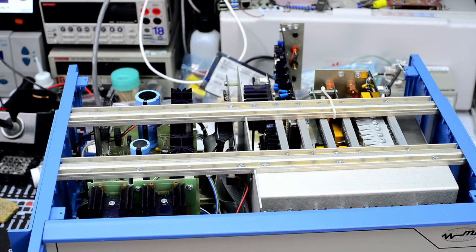Well, the taps, actually there are 16,384 taps, and also the residual between the taps is measured with the EMA10, which has noise of around 0.3 nanovolts, so that is 300 picovolts. Essentially, whatever the disbalance there is, the bridge will measure it and use whatever nanovolts residual to calculate the resistance value, actually the ratio between two resistances, to 9.5 digits stability.